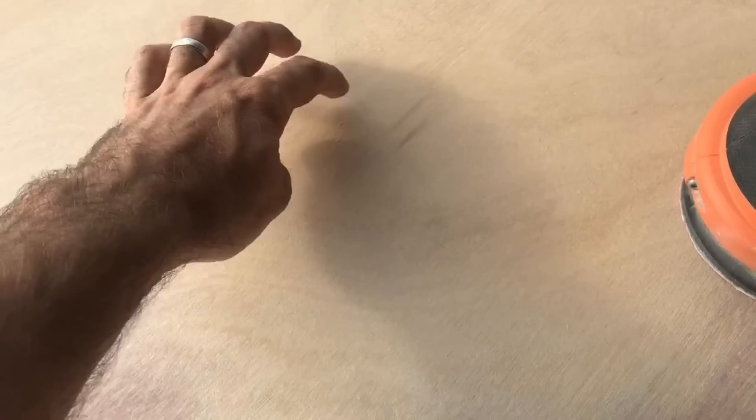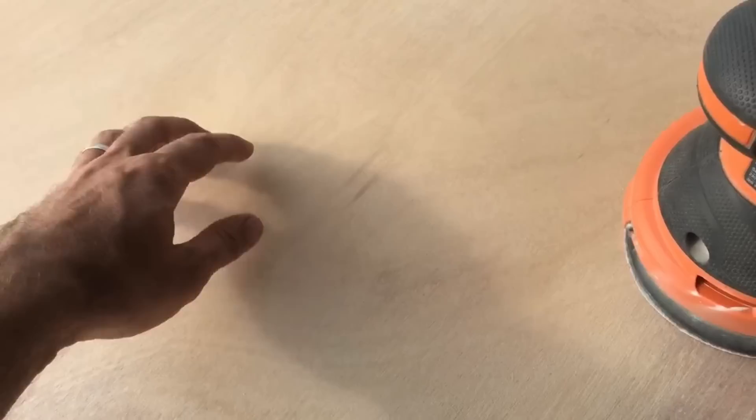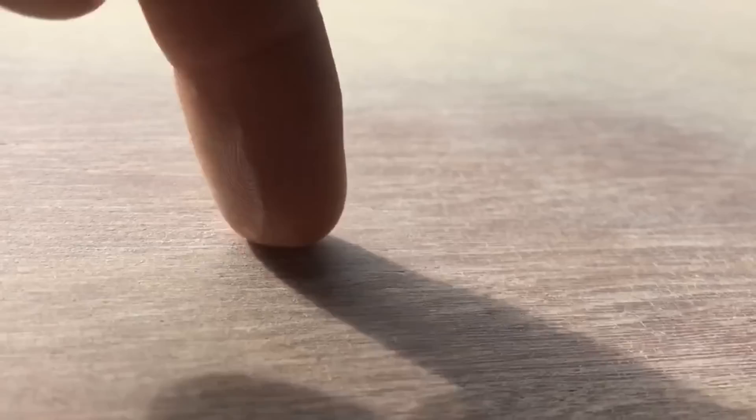The top layer is really really thin - maybe a fraction of a millimetre, maybe quarter of a mill. So it doesn't take a huge amount to sand it down to this darker layer. When I get it down to this level, there's much less of these flaky wood bits coming off the top. So it seems to be much easier to get it down to this level and then two-pack it and start using high build paint to basically fill those up and fair the wall so it's much smoother. That's the plan for our walls.